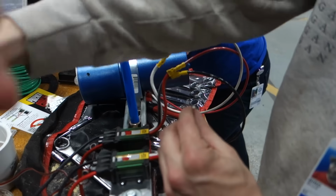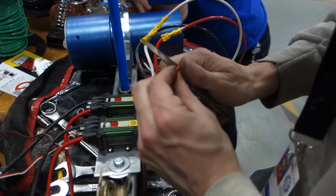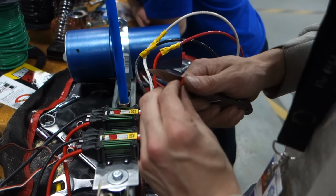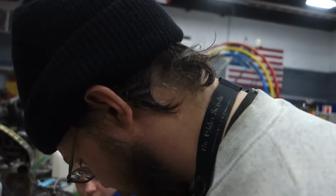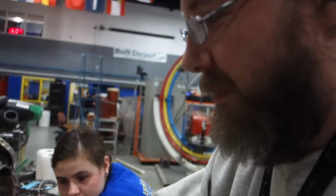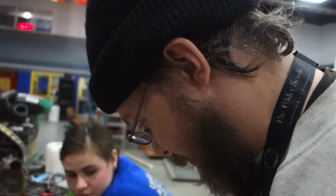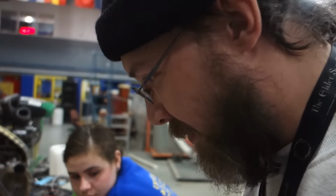Nope. That one will take a little bit more. Okay. Because if you crimp down anything in there on the silicone, you get a flakety, sparkety, self-heating joint. And it'll remove the silicone all on its own. But it takes a lot to get silicone to burn, and it's less than it takes to get the plastic around it to burn.